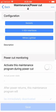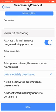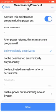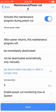This is where you will also enable power cut monitoring features. While scrolling down, you can also program the delay to return from power cut mode to normal operational mode. For example, if you have a power cut programmed and a power outage activates, and power is now restored, you could delay the power cut by 5 minutes, meaning it will remain in power cut mode for an additional 5 minutes. I use this feature in the event of any brownouts that may happen on the initial return of power.